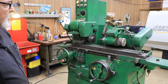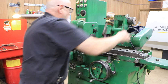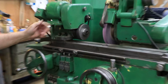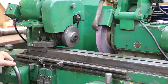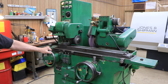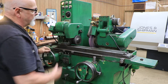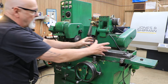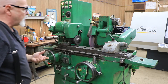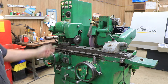The ID attachment can be swung back out of the way and now you have an external grinding wheel. You can manually do small jobs in your shop where you don't want to use a bigger, more important machine. You could put a center in here, put a point on something, or turn it to 30 degrees and sharpen centers. There's a tail stock that mounts here, and you can do regular cylindrical grinding between centers using a 5C collet with a center nose or hold the center in the 5C collet.